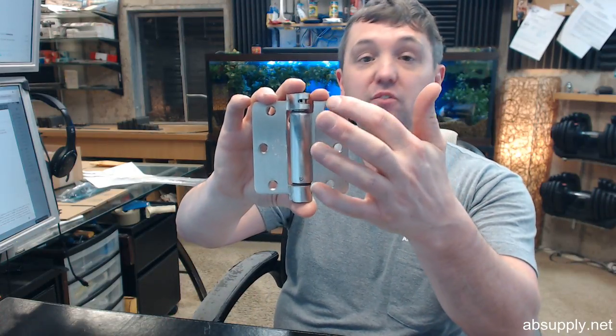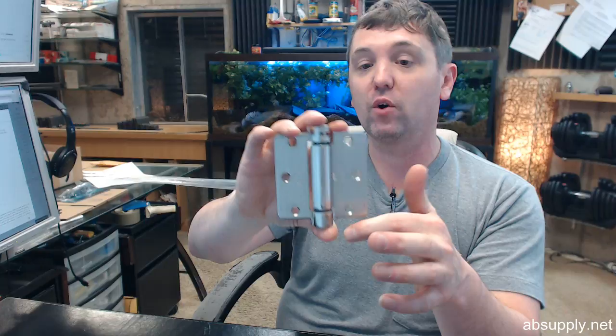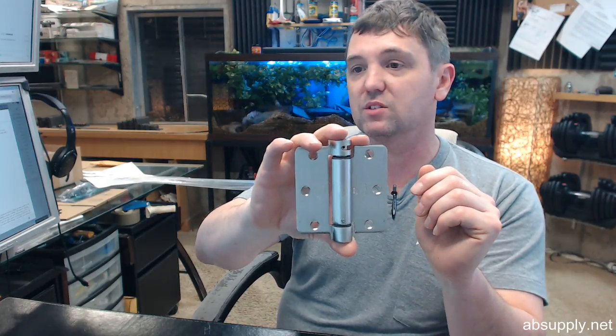It really doesn't matter when you have a square hinge where the height and the width are the same dimension, but it would matter if your hinge was a wide throw or maybe you had a 4-foot hollow metal door hung on 5 by 4.5 inch hinges — it would be very important to know that hinge was 5 inches tall rather than 4.5 tall. Anyway, nuance aside.